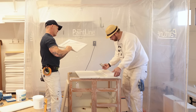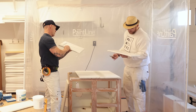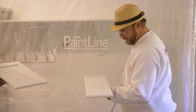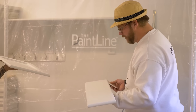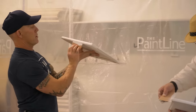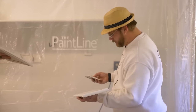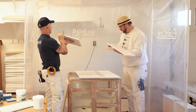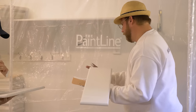So you primed these cabinets first, right, Michael? Yes, I was always afraid of tannin bleed, so I've used Cover Stain, and I've just had good luck. I primed these about a week ago. So you like Cover Stain primer? I do for the stain blocking and the sandability, but it is an oil, so I'm realizing now that there are other ways to go about cutting out that step.